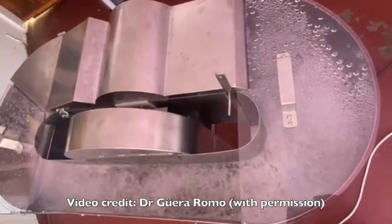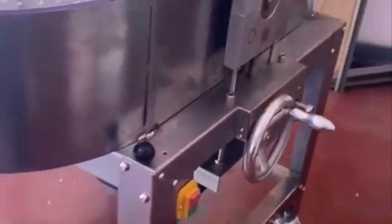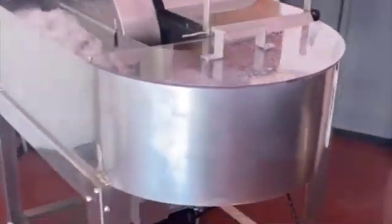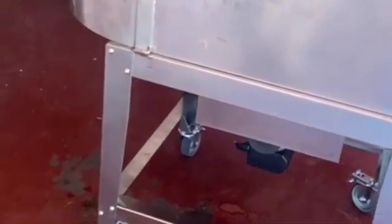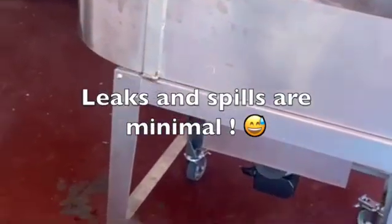She's not grinding it in too deep because she wants the fibers to be not too fine. If you make paper, you would mesh the rotor with the bed more. But for this purpose — to beat up fibers of cotton and pieces of material — it works very well. I'm also very happy with the way it turned out. The seals where the rotor runs through the top seal very well, and there's minimal spillage.